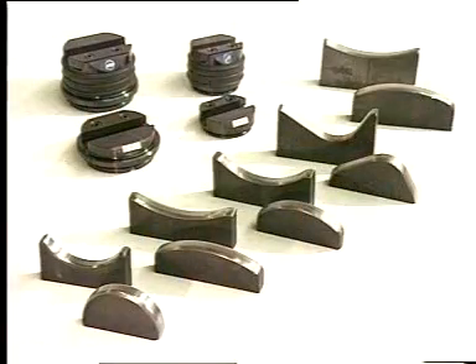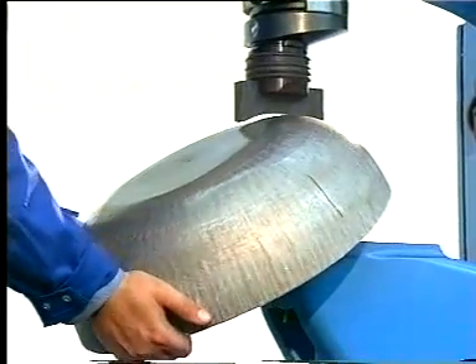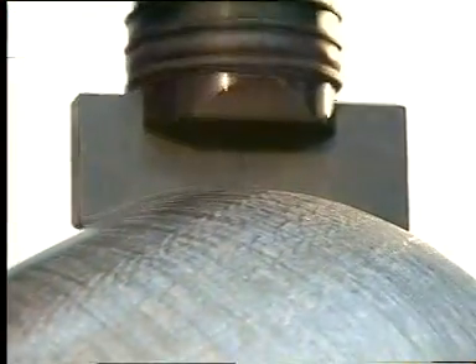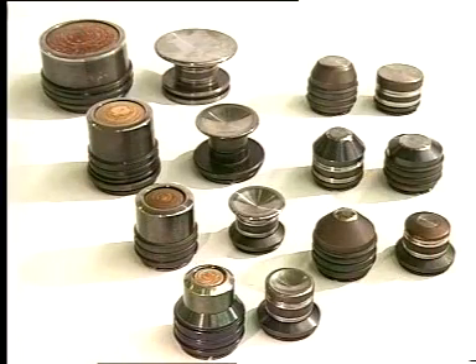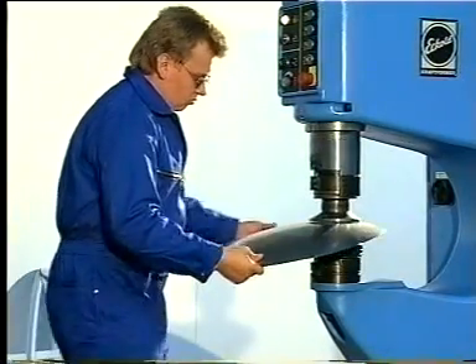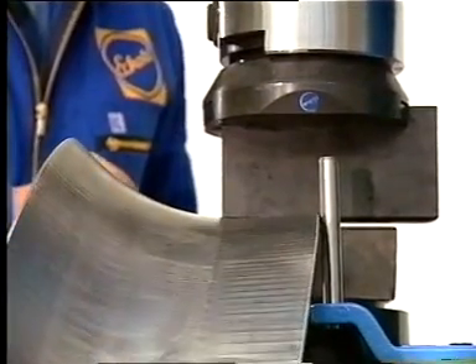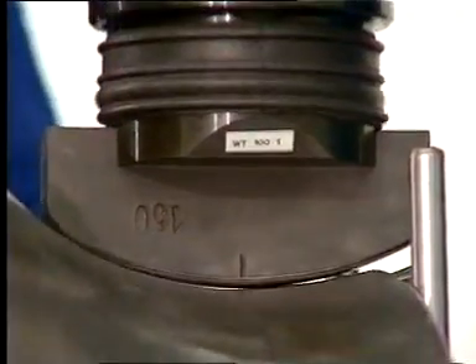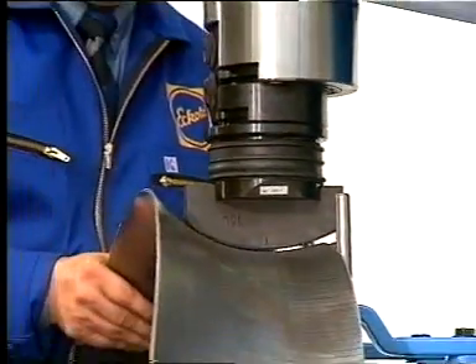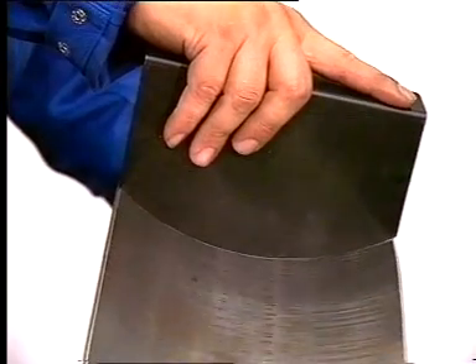The tool palette for precision forming. Using one of these special forming inserts in the universal tool carrier, the part is first shaped to the required form, while at the same time planishing its surface. The stroke speed in this case was increased from 300 to 600 strokes a minute. The doming tool turns a similar even round shape in one forming operation into a tri-axially curved dome, while simultaneously planishing its surface. With this tool, the edge of a manifold is partially stretched. Dimensional accuracy is ensured by means of an adjustable tool stop. The second step then achieves the desired result. The reformer gives the workpiece its precise radial contour. A template is used to check the precision of the final result.